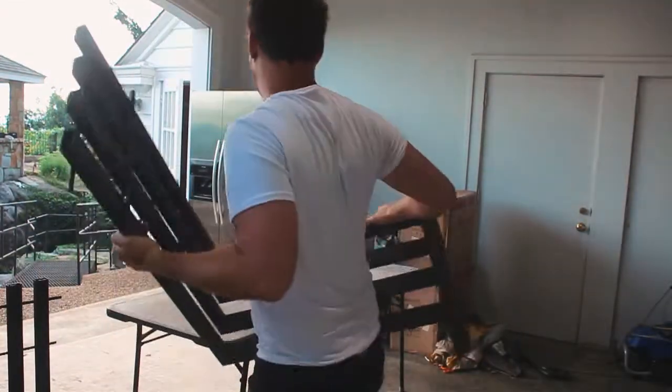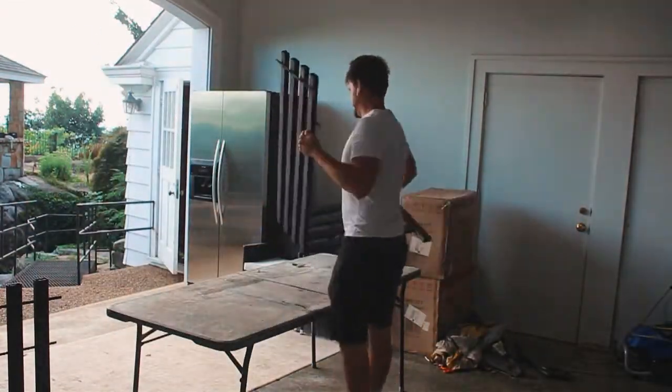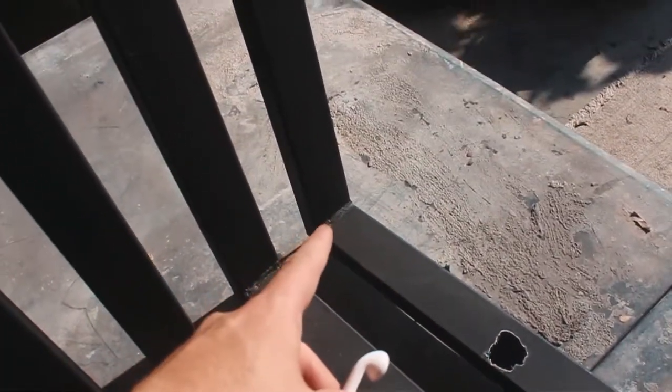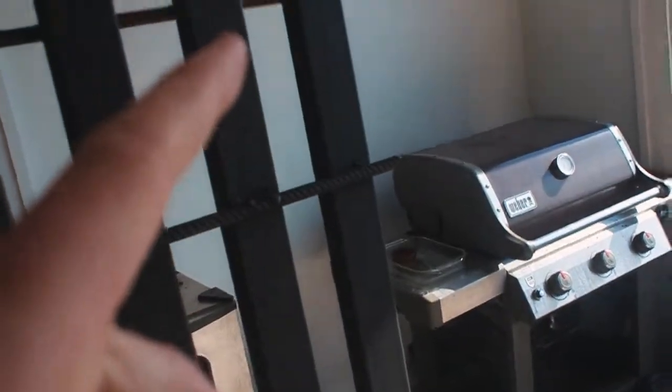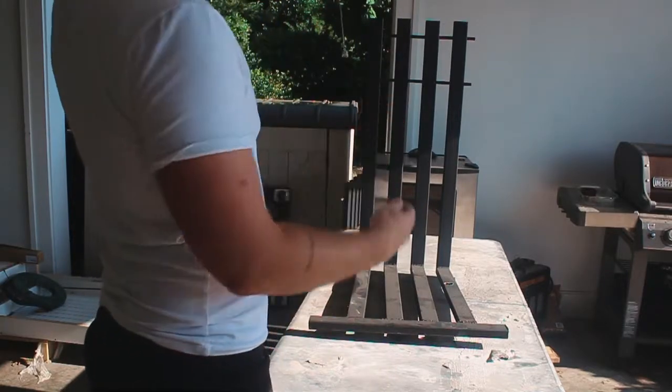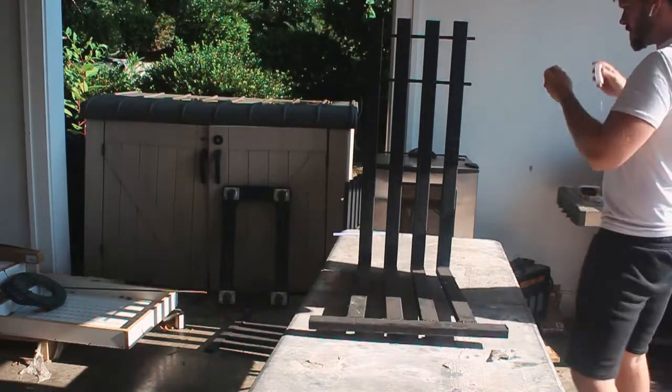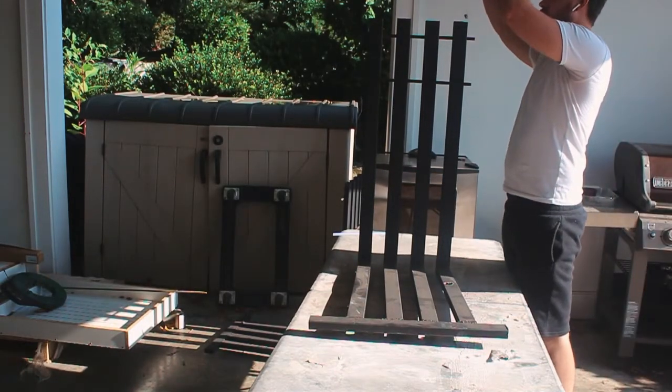What's good guys? Today we're going to be building the concrete beer pong buffet table. Right now I'm working on running the wiring for the LEDs that'll be on the bottom side of the table. Planning on running the wiring inside the frame there so that it can be stubbed up right at the floor and right at the underside of the table so that you won't be able to see any of the wiring.